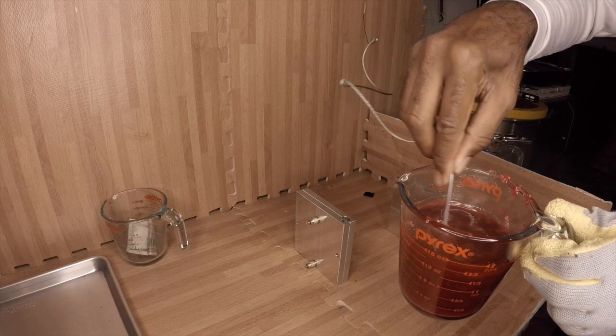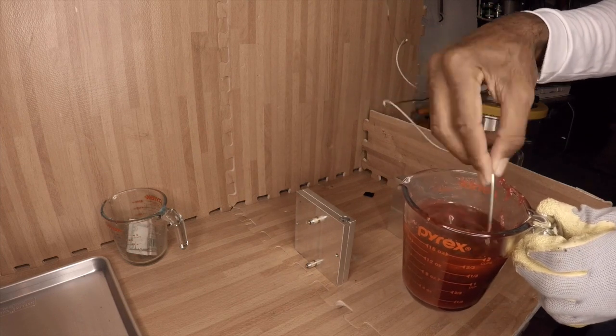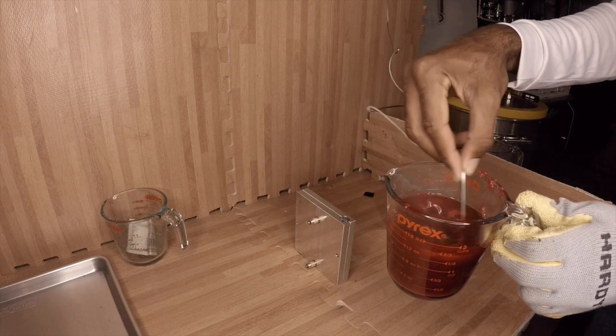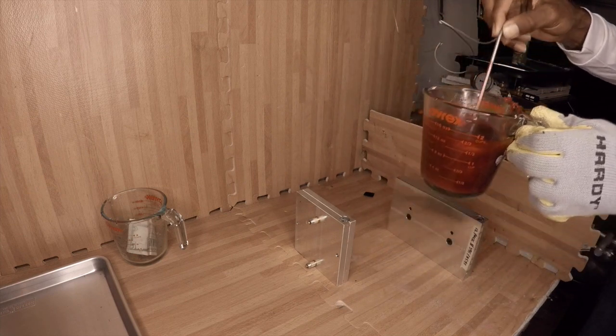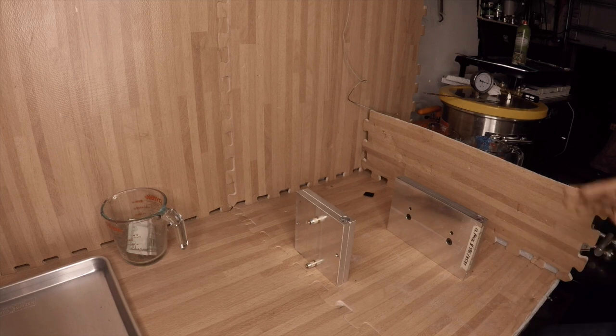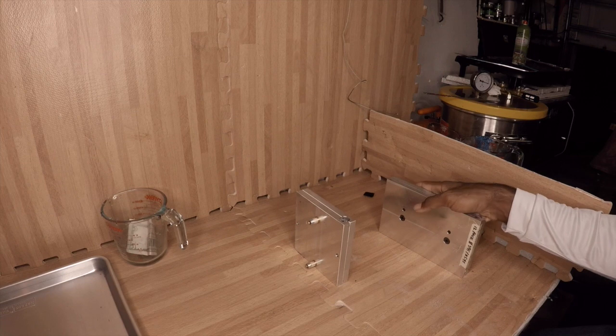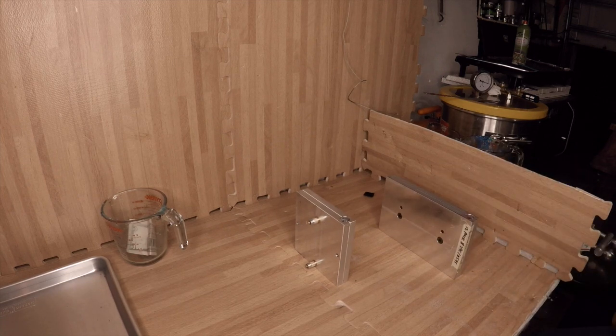Alright guys, so I'm going to test my temp now to see where we are, and I am right at 327. Gonna boost it up, well, 330. So I'm gonna boost it up for about 15 more seconds, just to get me closer to 340, 345, because the mold that we're going to use right now hasn't been shot today, and it's a little bit cool. So if I bring my temp up a little bit, then it'll heat the mold up.